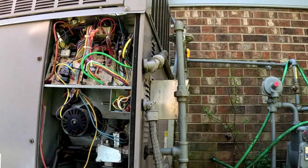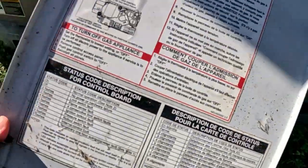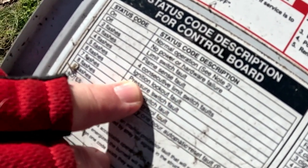I can't see any lights on this board — that's kind of a bummer. Oh, there it is, way down there on the bottom behind that wire. One, two, three, four, five, six — six flashes. So what is a six flash? We've got Spanish and English: six flashes is a pressure switch fault.